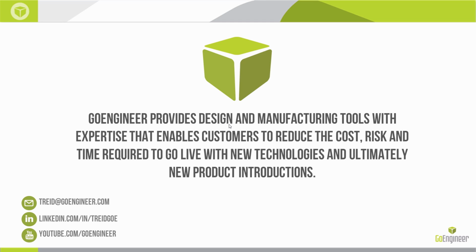And that does it for our presentation on printing scale models. Remember the important things to think about is, first ask, am I scaling it up or scaling it down? Do I have features that are going to become concerns? Are walls going to become too thin? Am I going to lose clearance between moving parts? And address those. Okay. And when it comes to color, depending on how you want to do the color, you might be coloring separate bodies, you might be coloring faces, or you might be pulling it into Photoshop and doing the coloring there. If you're working with a service bureau, make sure you send them the file and ask them what they would prefer or what they would recommend. If you're working with us here at GoEngineer, we'd be happy to give you some recommendations as to what's going to be the best workflow for you.